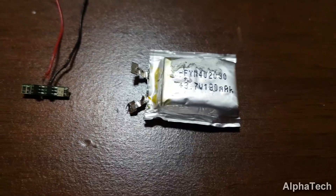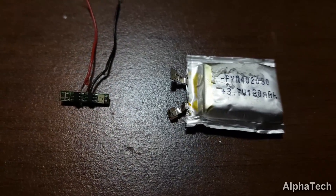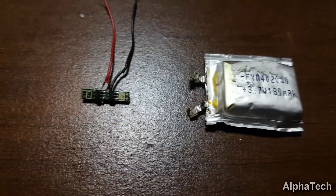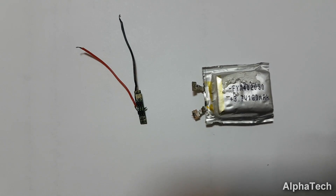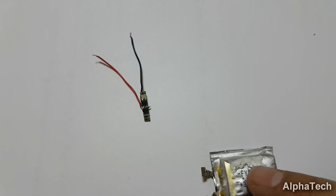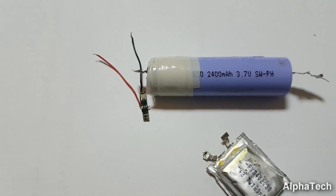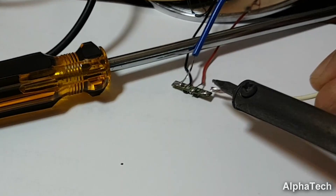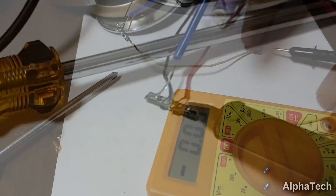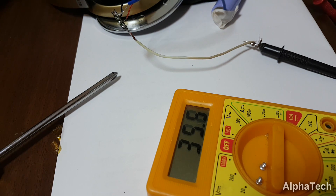The original battery was damaged and it wasn't charging or providing sufficient playtime. It is a lithium polymer rechargeable battery with a capacity of 180mAh. The one I'm going to replace it with is a lithium-ion 18650 with a capacity of 2400mAh. So we need to make calculations to have some info on the improvement in playtime that this upgrade will introduce.